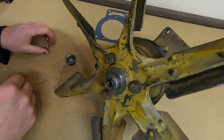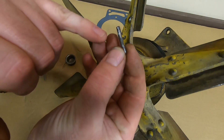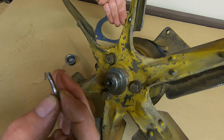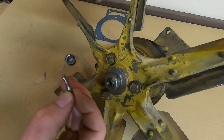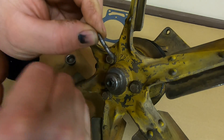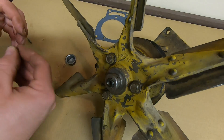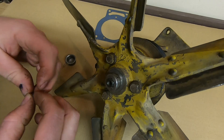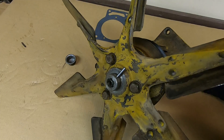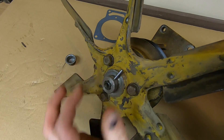Fan is tight. Now to put the cross pin in — here's the old one. This controls the thrust of the impeller and shaft; the impeller is always trying to push back away from the water pump housing, which is why the impeller shaft wore so heavily on the front side. It wasn't too big a deal to make a new one — I had some round stock of the same diameter — so it just slides through once I align the impeller shaft with the hole.